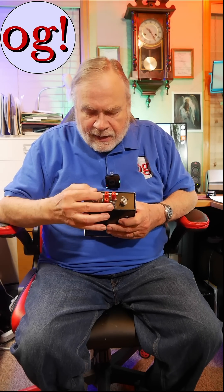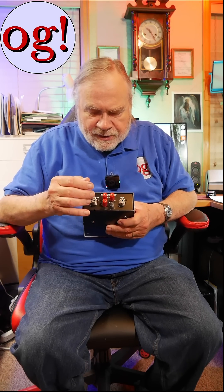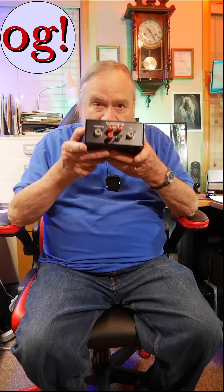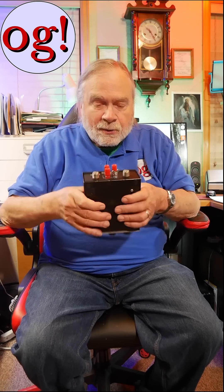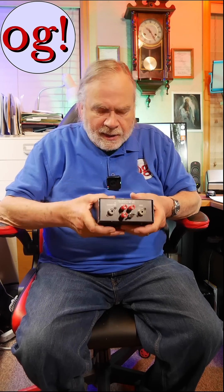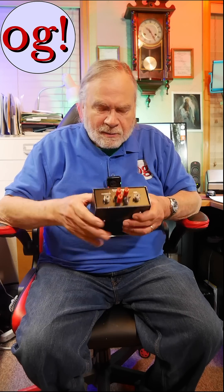Here's where you connect ground, and then, if you want to do a balanced output, you connect a little jumper from here to here, and then connect your balanced line across here, and this will get you where you need to go, or you can connect a random wire here, and it will tune the random wire and forget the balanced line.